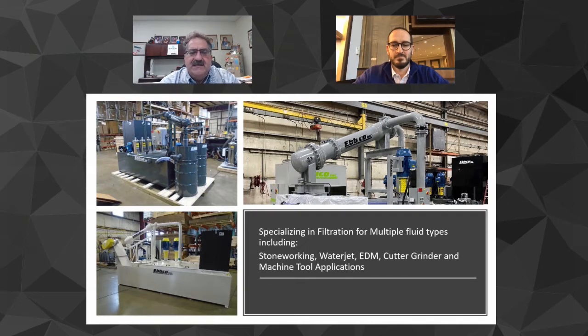Below that, you'll see a grinding system for a large 100-inch diameter Blanchard grinder. Blanchard grinders are precision machines that magnetically hold a part in place, and they could put 100 bearing plates on there and grind them all at once, and it makes a huge amount of sludge. If you see that little yellow deflector plate on the side, that's a drag flight that drags the real heavy solids out, and then we again polish it down with the centrifugal separator.